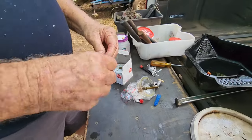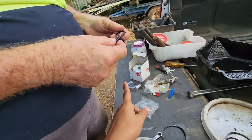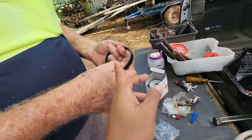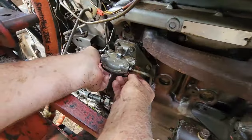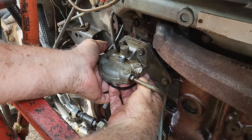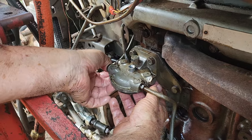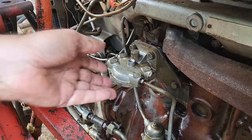And we'll fit it in. Trying to find which one. So this one you need to put one in here. I think they give you a spare. And you have three rings there. One ring will go on top of that, on the head of the filter assembly. So you just work around it with your finger, and it will stick. Like that, it won't fall.